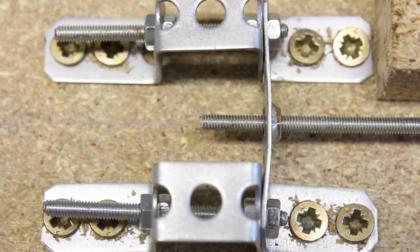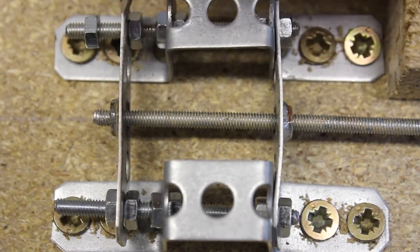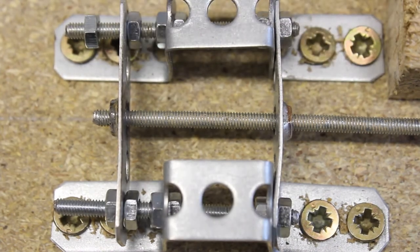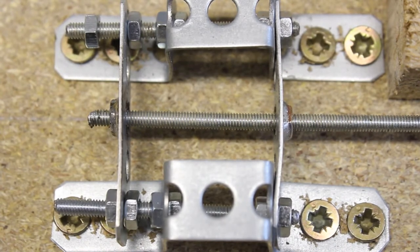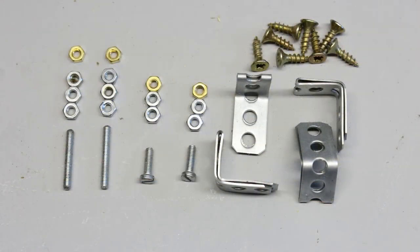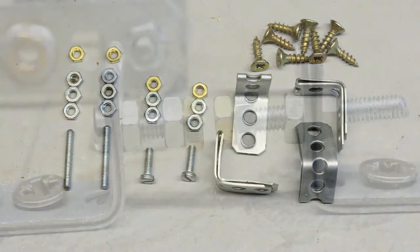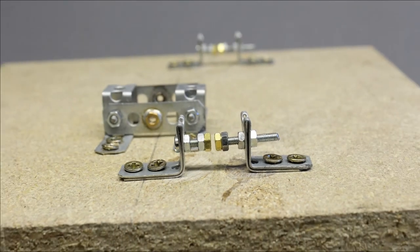There is some clearance when using just one nut for the drive. The second metal stripe is mounted in such a way that the clearance is as low as possible. The lower the clearance, the higher the friction — the right adjustment is a compromise between friction and clearance. The axes are guided by the middle aluminum bar using perforated metal stripes as well as 3mm screws and nuts, again using press nuts at the ends of the screws to reduce abrasion. The adjustment is a compromise between low clearance and friction.